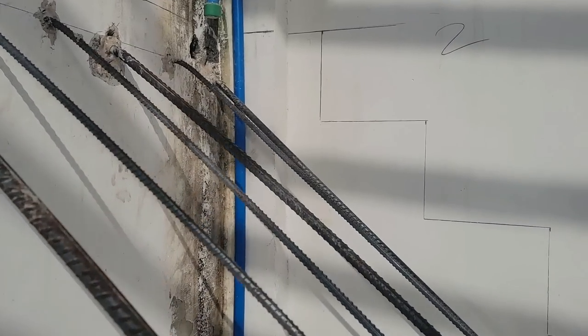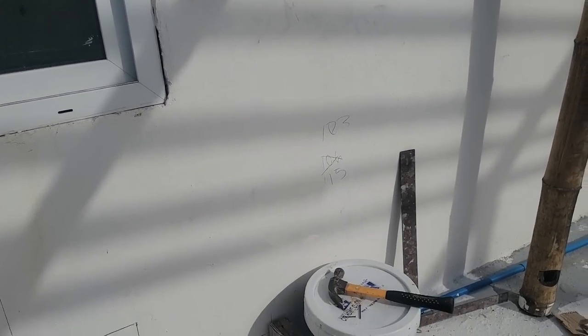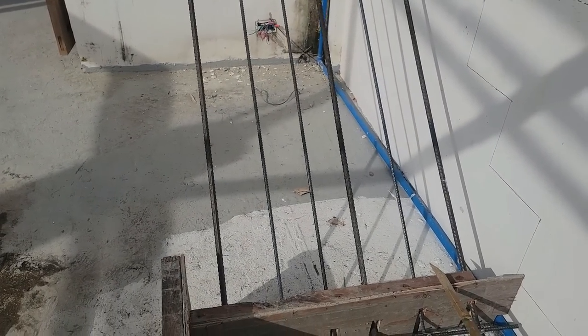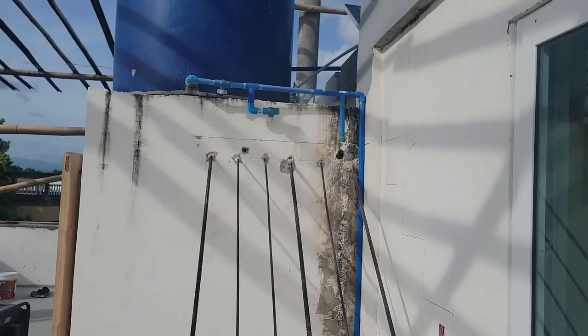And then same thing, we can't be drilling down this sidewall either because there is my main breaker box right on the side of this wall right here. And conduits from all over the entire house go up in that wall and actually underneath this step right here in this concrete deck too. So we do not want to be drilling into it. But it's just a short little staircase. And when he sets that and sets the steel anchored in nice and tight up there, nice 16 mm and 10, well then it's not going to be able to go anywhere.